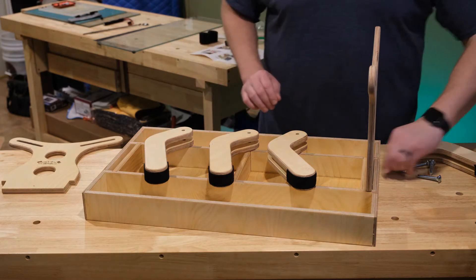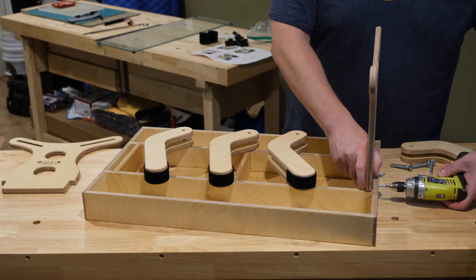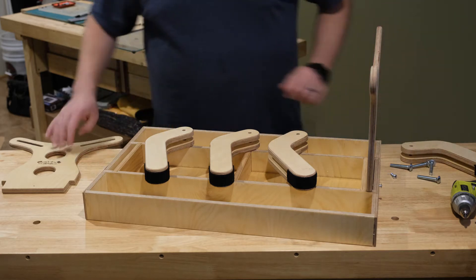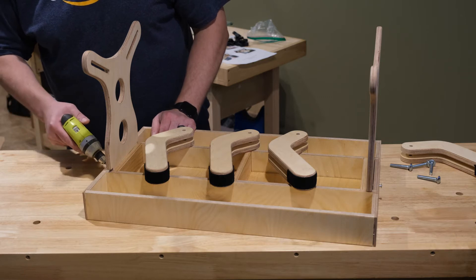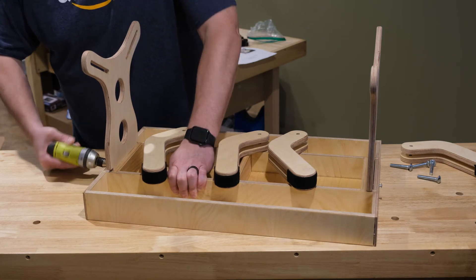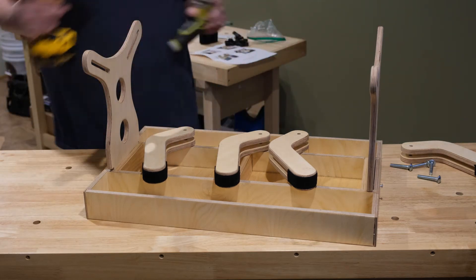The end pieces go in with a single wood screw, and this isn't glued or anything, so you can take that screw out very easily if you need to tear this down or save some space. You're watching me put this together for the first time — my little mini Ryobi drill doesn't have the power to do it, but it's good enough to keep it there for now. I didn't set one side all the way down — there's a little gap at the flange. I pulled out the screw and reset it. You just need a little bit of power to get these in all the way.